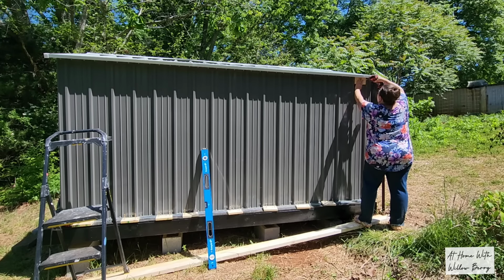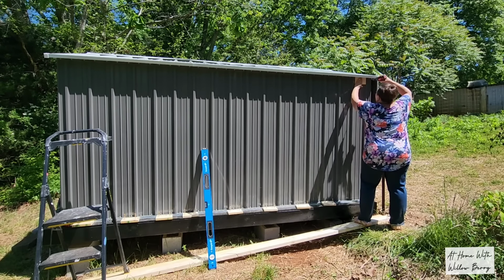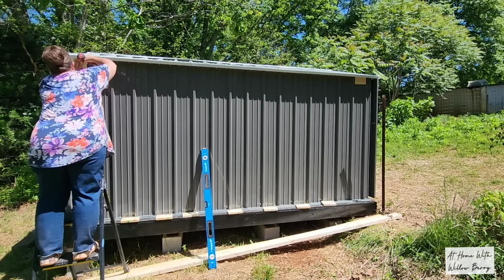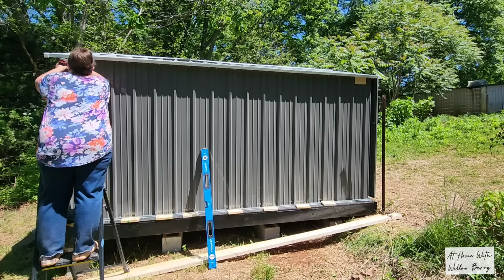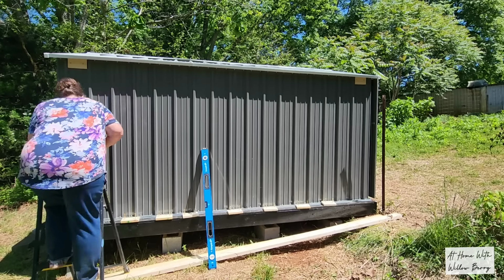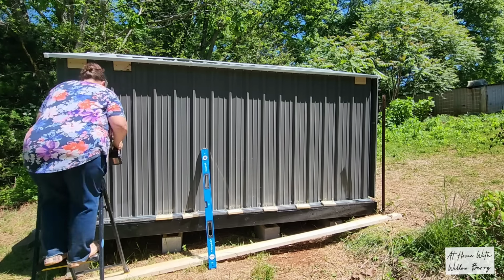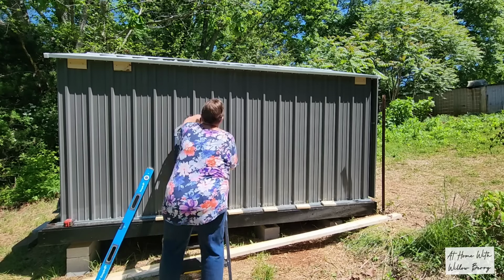Inside the shed, holding up a 2x4 board that I am screwing these small blocks of 1x4 boards into, and then we will screw on a long 1x4 board as well. We're basically sandwiching the shed wall between the two boards in order to make sure the gutters have a strong structure to attach to.